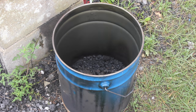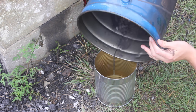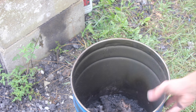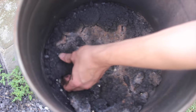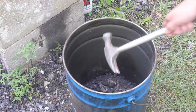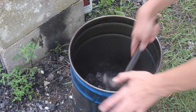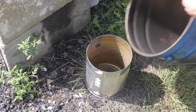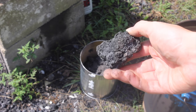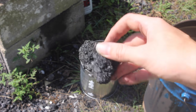The next morning, I examined the coke and found that there were two parts to it. One part was loose, which I poured into a can. What was left was what had been fused together by the coal tar released during the heating process. I used a claw hammer to break it apart so that it would come out of the can, then poured the rest into another can. Coke is very brittle and light, but unlike coal, it is gray and very porous.